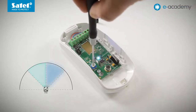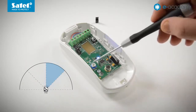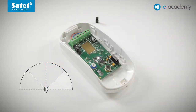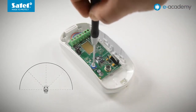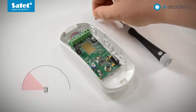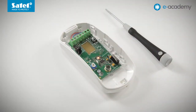I keep turning right. Now the detector is flashing the third color. As I mentioned earlier, blue is the color that is set by default in all slimline detectors. After setting the potentiometer closest to its rightmost position, the LED starts flashing white, which is the last of the available colors. Now I set the potentiometer, for example, to the position corresponding to red. To complete the procedure, I place the jumper back across the LED pins. The detector has remembered the selection and from now on it will signal an alarm or trouble using the indicated color.